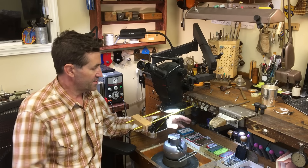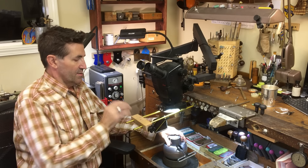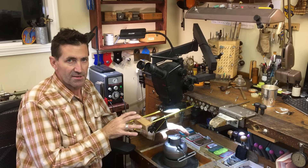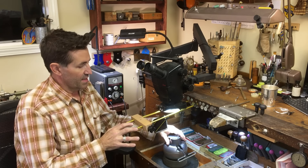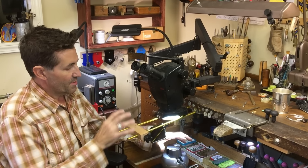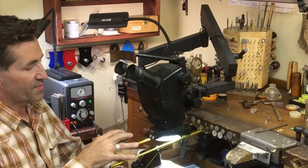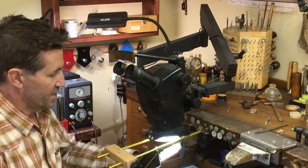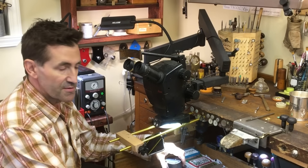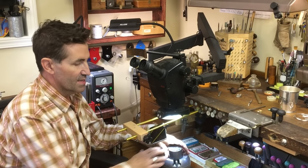We are ready to get started. We've got our plate chucked up in the vise, we've got sharp gravers, and best of all we've got this funny-looking contraption here. Engraving is notoriously hard to photograph and film, and we're using iPhones which makes it doubly hard. So I had to come up with a system to show off the engraving and allow you to see it as I'm cutting it — and I think we've got a solution. We're going to cut the first section of scroll using the Graver Max pneumatic handpiece, then move on to hammer and chisel and hand push.